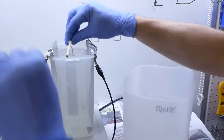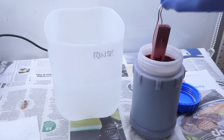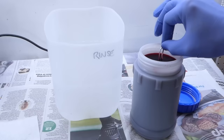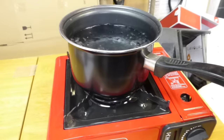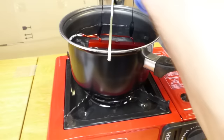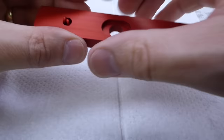When the time's up, the power is removed and the part is thoroughly rinsed in water. Next comes the dyeing — this is optional; the part can just be left its natural colour if you just want to make it more corrosion or scratch resistant. Just agitate the part in the dye until it reaches the colour you want. This is my first go with real metal dye and it's miles better than anything else I've used — the colour is deeper and fully absorbed. Other dyes I've tried look okay until the rinse, when a lot of the intensity just washes off. The final stage is to seal the part by simmering it in boiling water for about 40 minutes.